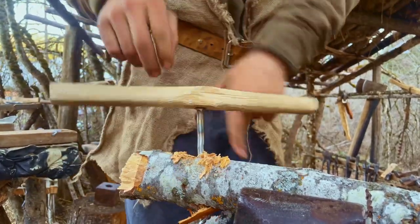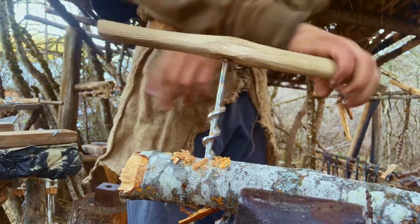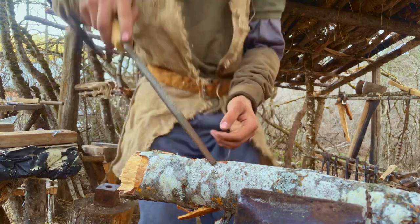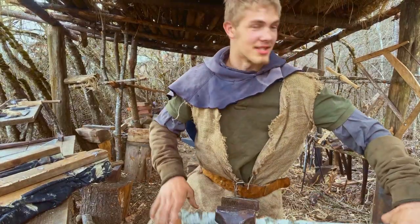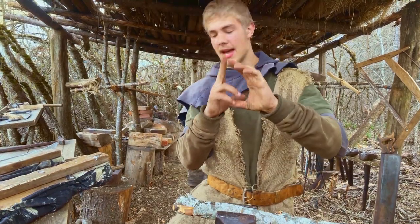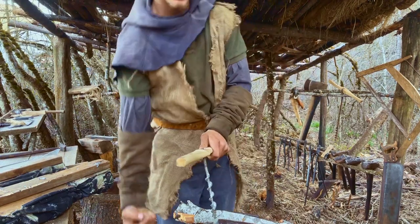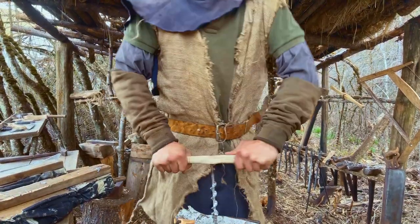What I'm doing here is a technique known by woodworkers as mortise and tenon — I did say 'lock and mortise' but I meant mortise and tenon. It's been used for thousands of years, very reliable. This is pretty soft wood, probably not the best to use, but it's just what I had laying around. If you don't know what mortise and tenon is, imagine an axe: you have the eye of the axe and the handle slots into the eye. The eye would be considered the mortise and the tenon is the handle slotting into it. So here I'm drilling a hole, which is the mortise, and then I'll be cutting a piece of wood to press-fit into that hole — that piece is called the tenon.